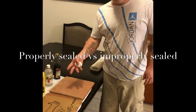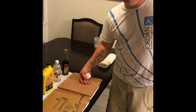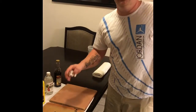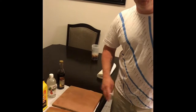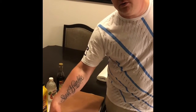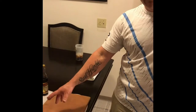I'm doing this video to show you the difference between a sealed Saltillo and a non-sealed Saltillo tile. Sealing is the most important part of these particular tiles when you take them right out of the box, because you're either going to stain them first or seal them, or just straight seal them, whatever direction you're going to go. Today I'm just trying to show you what they look like sealed, how they should work, how they should repel oil, greases, red wines, some of these things that you'll see over here.